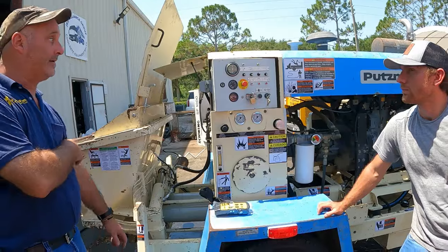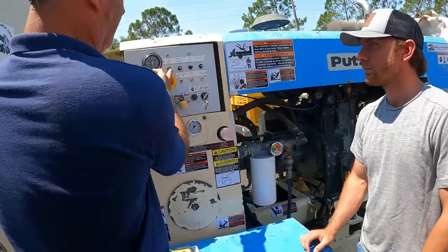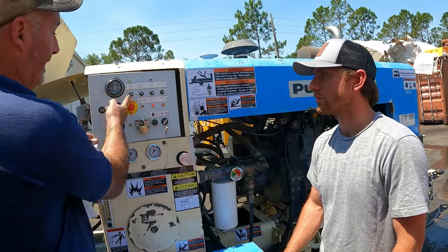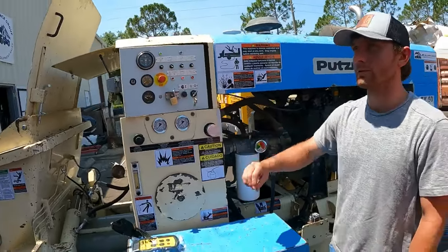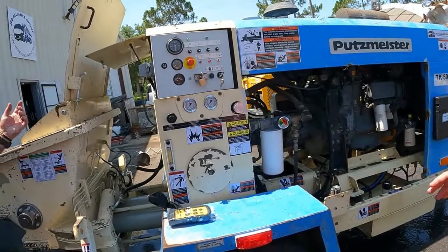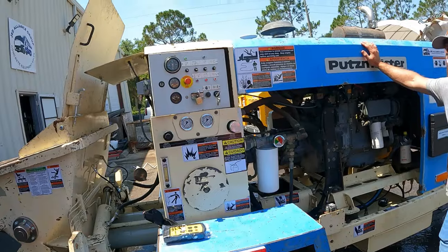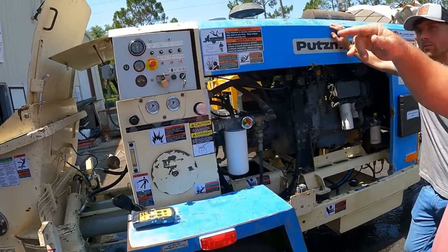So he is correct. Anytime you go from forward to reverse, you must turn the machine off, go into reverse, and then go back into a forward gear. And never do it while it's running. It won't happen today or tomorrow, but in a year, it'll finally jam and it'll be stuck. What position is it supposed to run in when you're pumping?